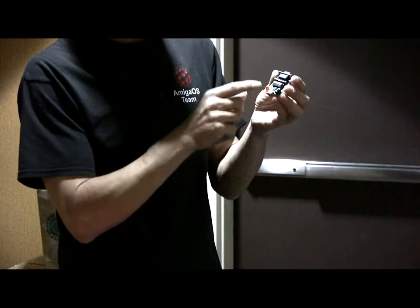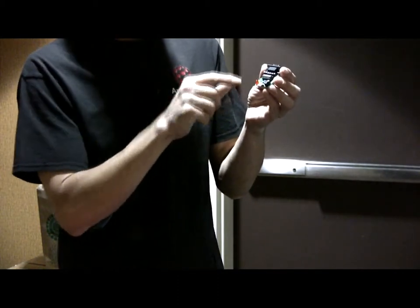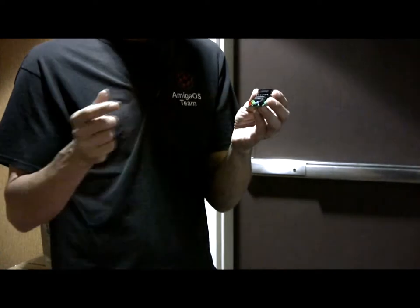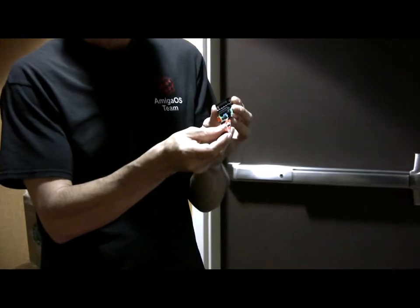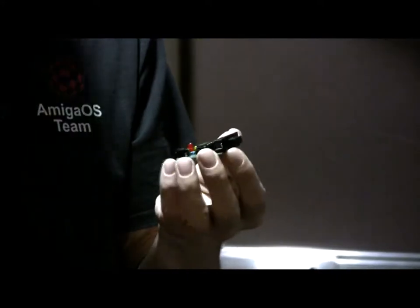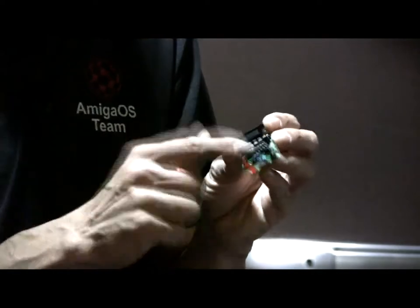What this does is it basically copies all the ones and zeros, but drops the voltage down to 5 volts. So you basically have to put that between the Arduino, or any device you would plug in directly, to take the voltage down. But these are fairly cheap. I got a bunch of them. They're like $3 a piece if you assemble them yourself. And there are some even smaller versions. But this is really handy to have.